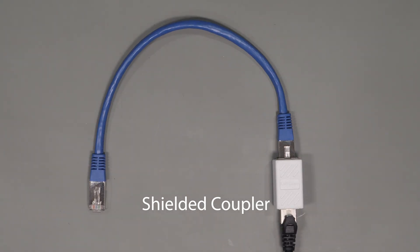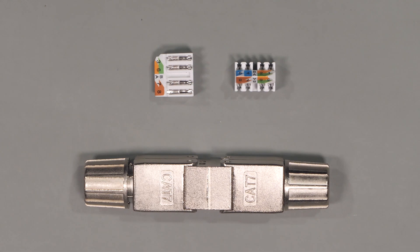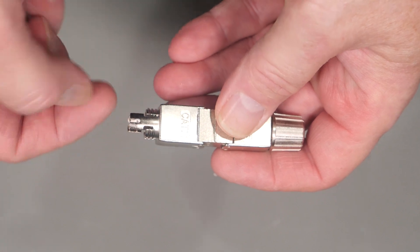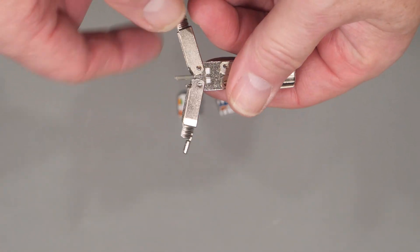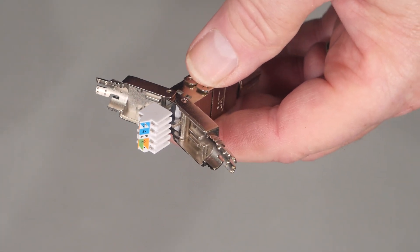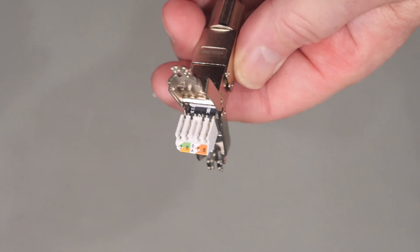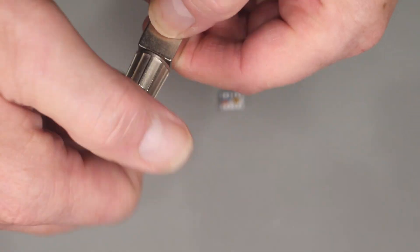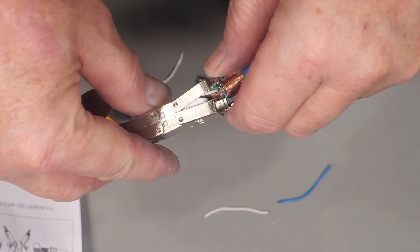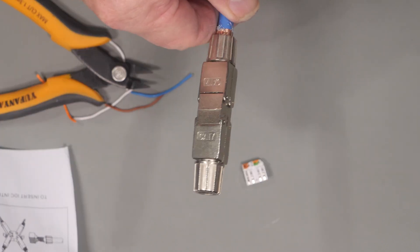On the topic of extending cables, there are a couple of options. In most cases if you just need to extend a cable a few feet you'll grab a patch cable and a regular coupler. However when you need to repair a longer cable or cables in the wall you'll want a more reliable connection. One great option is to use inline couplers like these VCE Link tool-free couplers. These are designed to be tool-less, support Cat6, Cat6A, and Cat7 shielded and non-shielded cables, and are recommended for higher reliability and higher bandwidth connections, fully supporting 10 gig. I'll leave links to these in the description.